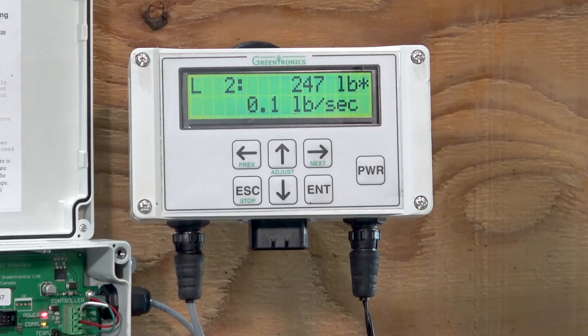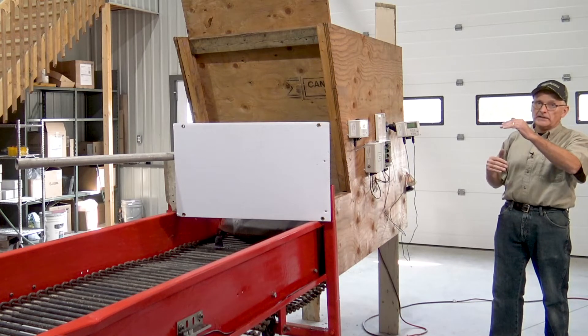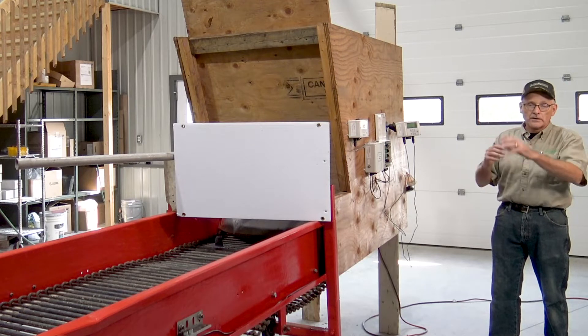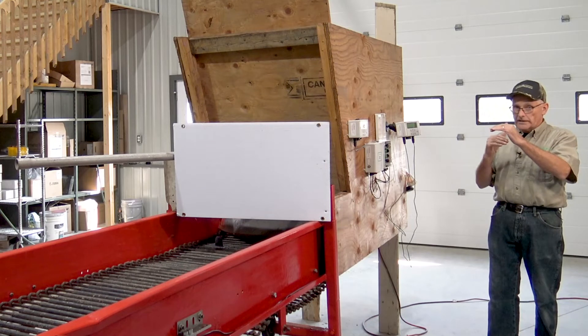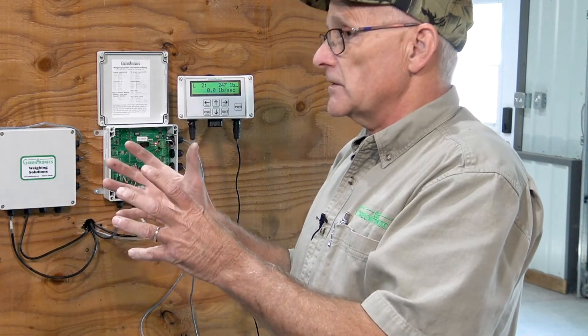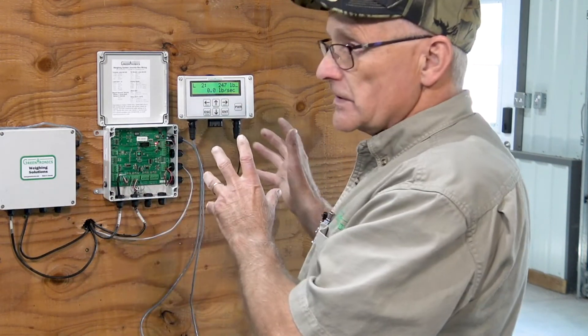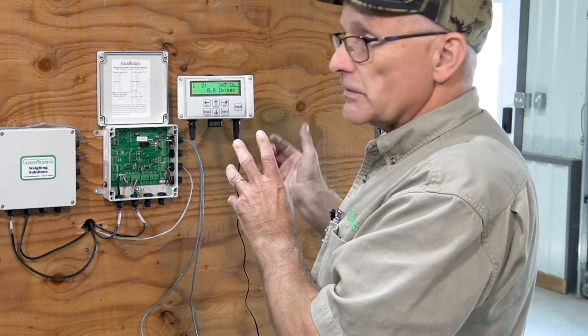I would say that that is really good. On a small sample like this, that's a good span calibration. I would not touch this again until we had run maybe five more samples, and then look at which way we're trending — are we always a little bit low, are we always a bit high? If we're consistently low or high, we can use the numbers from those five next loads, take an average, and enter those to bring our span calibration to a little bit higher accuracy. But for now this is really good, we're not touching it, and we'll see what the next loads do.